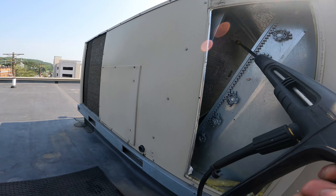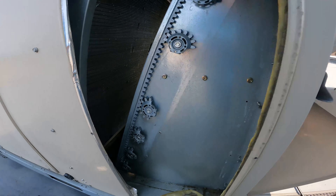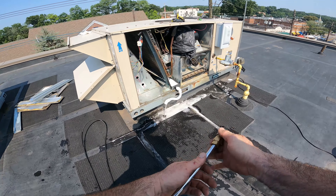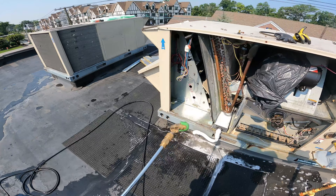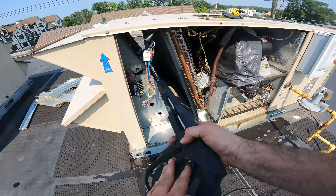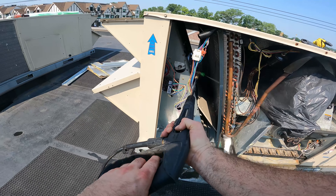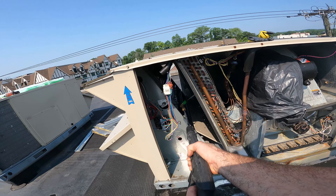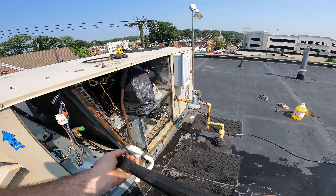We did get some splashing through but that's okay — I can hit that green stuff off. Unfortunately you can't soap on the angle, so I'll get that soap in there this way. Any bacteria, anything on this coil that might be putting off a bad smell should be gone. That's why I put this plate here so the water is just hitting that and not really going in.